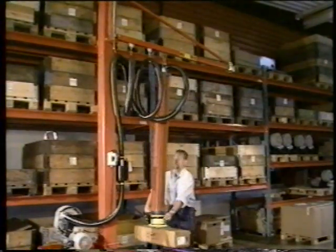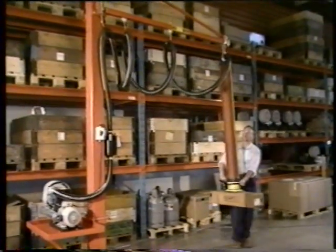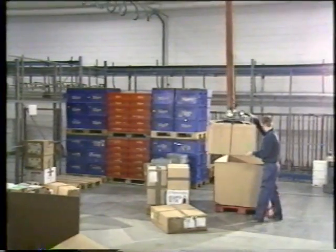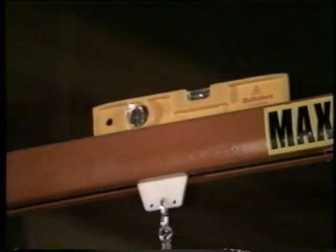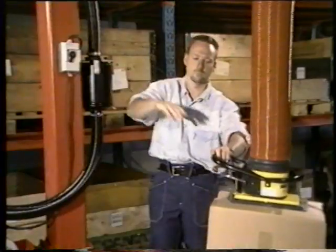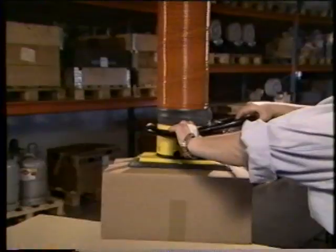During assembly, you must make sure that you can move the lifting hose freely and that it does not jam or become exposed to unnecessary wear. Plan the dimensions of the lifting gear so that you can work with VacuMove over the whole handling area. Make sure, too, that the gear is horizontal and the lifting hose doesn't move laterally by its own weight. The filter has a control valve to reduce the lifting speed when handling light loads. Adjust the free height, with and without load, to ensure that the control handle is within comfortable reach.